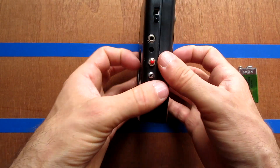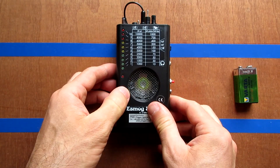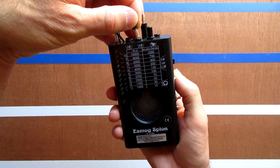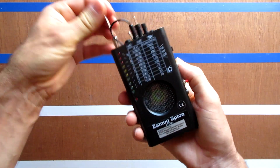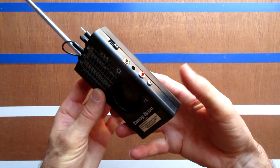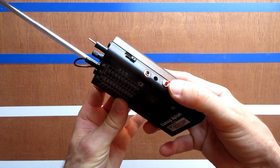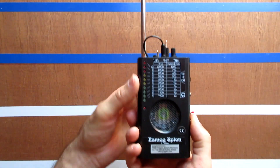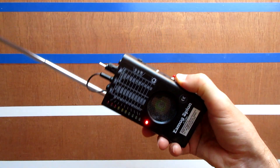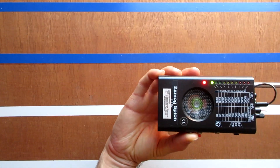It's helpful not to drop this device when doing measurements, because it opens easily. This is how you set the device to do electric measurements. I extend the telescopic antenna out completely for maximum sensitivity. For electric measurements, you must always touch the screw on the side. Always do this before you turn the device on.